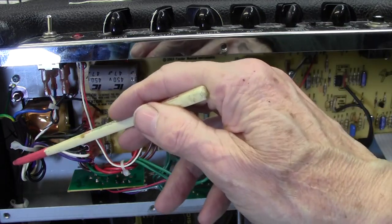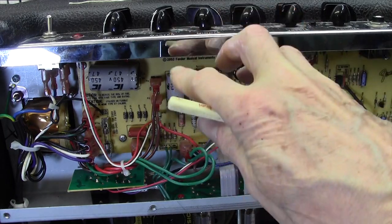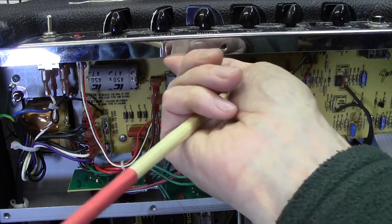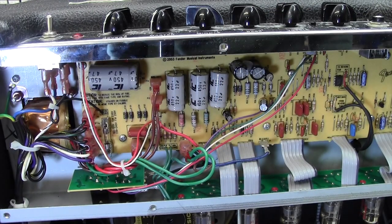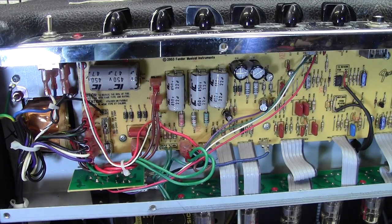I usually take out this cable tie here to loosen up these wires. And then you have to get your hands in and push down, take the knobs off obviously, push down really hard on here to just ease the shafts of these pots past this lip here, and it just about goes, allowing you to tip the board forward. So I'll do that and see if we can have a look behind that board, because I can't think what else it can be.